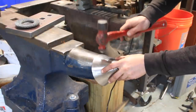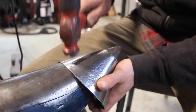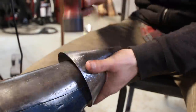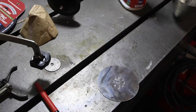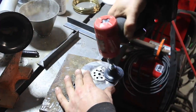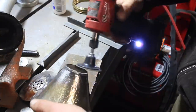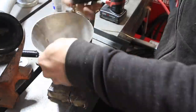I decided I wanted to add a little bit of texture to this thing overall, so I went over to the horn of the anvil using a ball peen hammer and just started putting in some little dimples. This was a pretty time consuming process, but in the end I think it helped with just the overall aesthetic of the piece and also hid some of my crimes — made sure it all had the same sort of look. I degreased the bottom plate and figured out how I was going to fixture it up. I made an attempt at soldering it and then had to go back and do it again, so here you're seeing me grind off a little bit of that braze. Once that was cleaned up, I'm able to fixture it up using a little piece of scrap plate, a clamp, and a piece of angle steel.